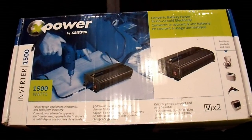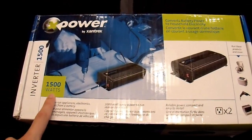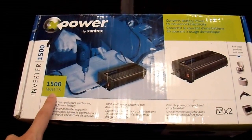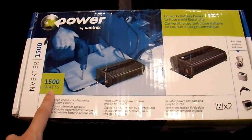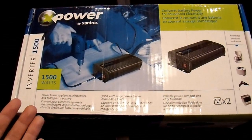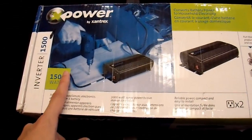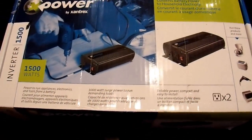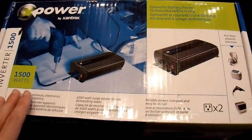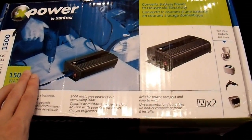The first thing you need to do is figure out how many amps your system is going to draw. That's pretty easy when it comes to inverters, because they say right on them — 1500 watts. So this inverter, long term, will only be able to draw about 150 amps. A 12 volt inverter draws about 10 amps per 100 watts. So 1500 watts, take off 10, you have 150 amps. That makes it pretty easy. If it's a 24 volt inverter, you cut that number in half. In any case, you want to know how many amps — 150 in this case. So we're going to size our cable for 150 amps.